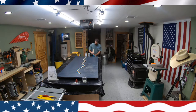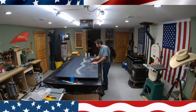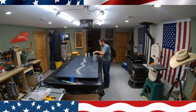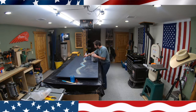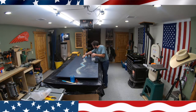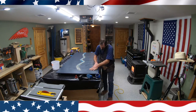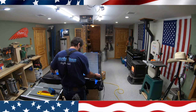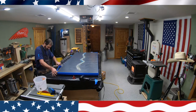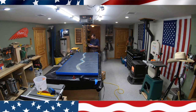My plan was to just do the river today, let it cure, then come back and do the whole thing in one day. Here I add some glass and push it into the river nice and neat, then add a few bigger glass pieces here and there. The next day I tape off the whole thing. This project is three foot by seven foot, so it's going to take two gallons of epoxy — I thought it would only take a gallon but it took two. I use Super Clear tabletop epoxy.